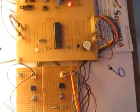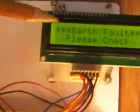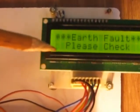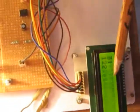If I switch on this slide, now it's displaying that arc fault is detected. And we are getting two values on the LCD board — 31 and 125. The lesser value we are getting from the second current transformer and the greater value we are getting from the first current transformer. The current transformer is connected to the microcontroller via this bridge rectifier.